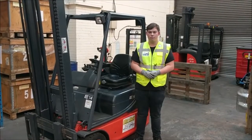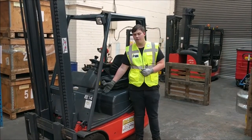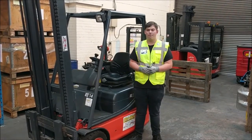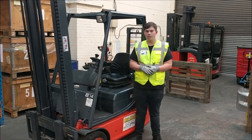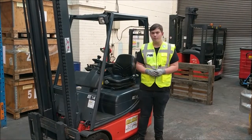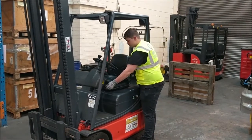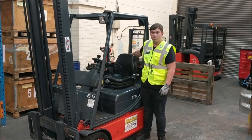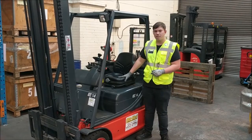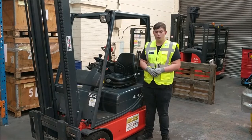Next, we're going to take a look at our upright position and also our seating and restraining systems. First off, we're going to take a look at the footwell of the truck, ensuring that there's no debris stuck behind the pedals and that the pedals have their rubber on. If the pedals do not have their rubber on and you begin to stop, your foot might slip, causing you to not have control. Next, we're going to take a look at our seat, ensuring that it's fully adjustable and that once it's adjusted, you can lock it in place safely. Also, check the upholstery of the seat to ensure that there's no rips, tears or gouges, as an uncomfortable operator will not be working to the best of their ability.